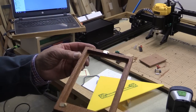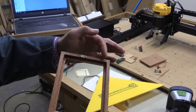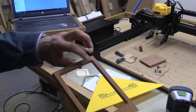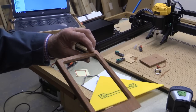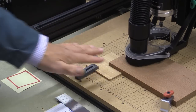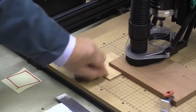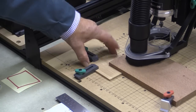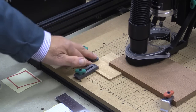Here is the finished piece. You can see it's got rounded corners — the radius is only an eighth of an inch so it doesn't matter. There's a nice deep channel and that lovely little chamfer on the inside with a little bit of relief going downwards by about a millimetre and a half. I'm really pleased with the way that's come out. Now I'll need to flip my piece of wood to do the underside, so I've got a corner cut out made of a bit of thin bamboo, locked into my bench top, so when I flip the piece over I can get it absolutely spot on.